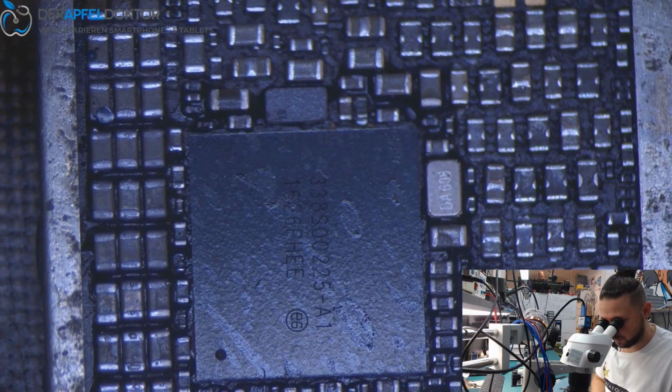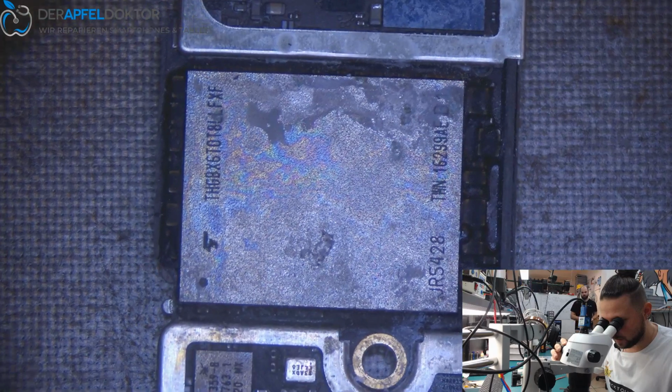What about this? Here the NAND is already out, baseband is out, CPU. Okay, this looks like a board we could take for swap. Let's see if it's a good board. Looks like it boots. Just let me have a look for an iPhone 7 test screen. Yeah, this board boots. Let it boot completely, and if this is good, we can use that just for swapping the board.